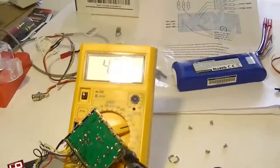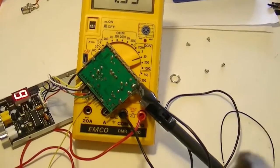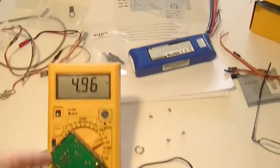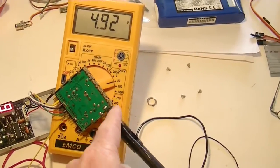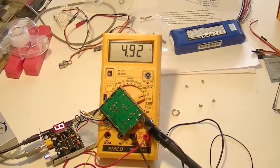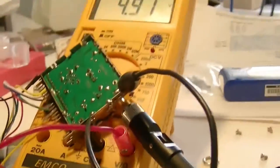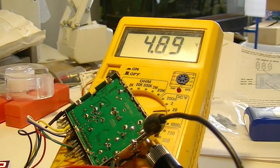Here's how it works. I have my multimeter hooked up to that pin — here's the yellow wire I showed you — and I have it hooked into the multimeter reading the 5 volts. The other wire is on ground from the multimeter on the frame. Right now I've got 5 volts because I'm receiving the signal. But if I come over here and unplug my video transmitter, watch what happens to the signal. Now, see the RSSI drop down? Now we're going to plug the transmitter back in, and the receiver should pick up signal, and the RSSI will come back up to 5 volts.